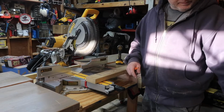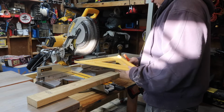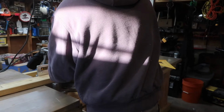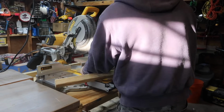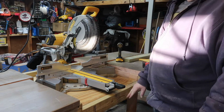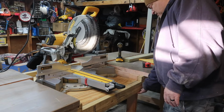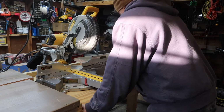Okay, so luckily I got a piece that's 26 and a quarter long. That's the last piece of 2x4. So I'm going to cut about a half inch off of there, so it fits in between here. We also decided to put it in front of the plywood. That way the plywood doesn't chip away. And then I'll screw it in. It'll be even with the 2x4s under it. Yeah, a little bit off. Because it's thick to the plywood, it's still a lot stronger that way.